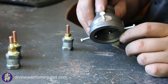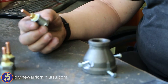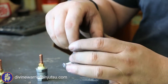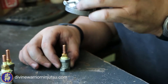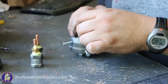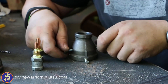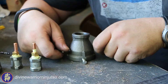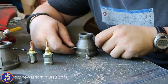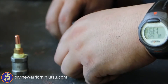Okay, so now the tap worked fine — we've got the four bolts in here. What we're going to do now is go back to our nozzles that we made earlier, and you can see that there's too low and too high. So what you're going to do is center this over top of your nozzle so that each of the bolts lines up with one of the flat sides that you made on your nozzle. And once you get it like that, then you can hand tighten them a bit.